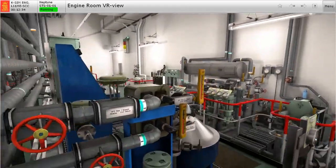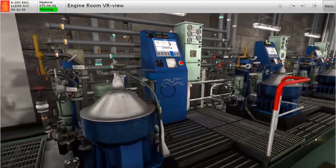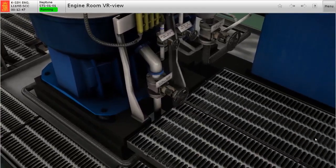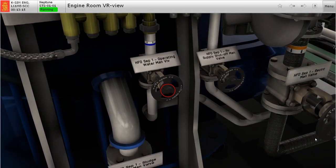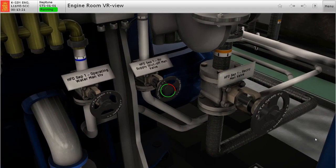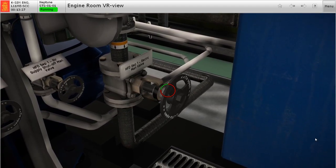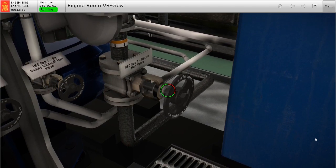Let's prepare the opening and closing water arrangements of the purifier. Some purifiers have a day tank where the pressure is at a calculated head pressure, but this typical installation is using a pressure regulator for its operation. Fully open the operating water manual valve, then open the air supply shutoff valve. The air is being used to trigger operational system requirements of the pneumatic system. Also fully open the fuel recirculation valve. This valve recirculates the fuel during the idling and discharging operations of the separator.